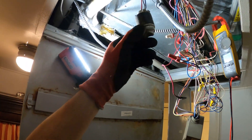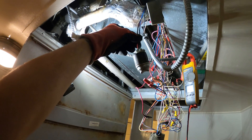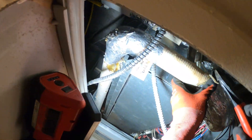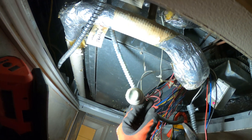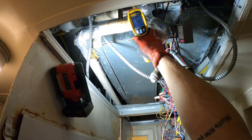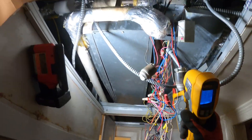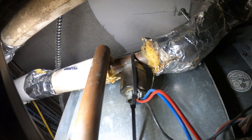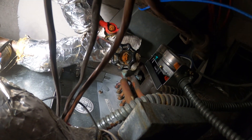What I want to do is put these pipe sensors in the right place. If it's calling for heat, I should put this on the inlet pipe to see if there's hot water. Got 104 degrees on the incoming pipe, so I'm going to put this one on there. These come with a little bracket but they're all gone, that's why they've got tie wraps. Hopefully that does it — it is on the hot pipe and hopefully that will open up this actuator.